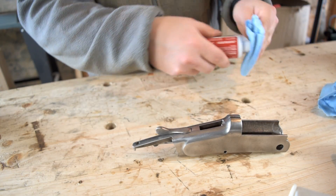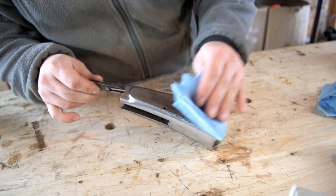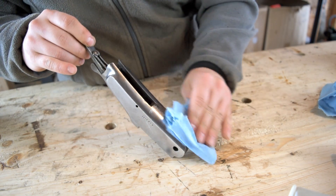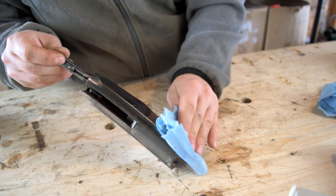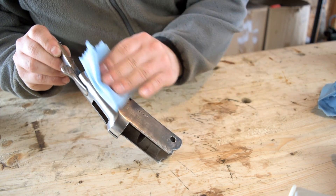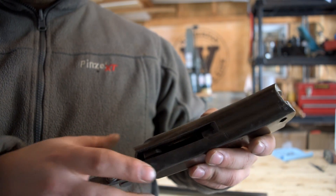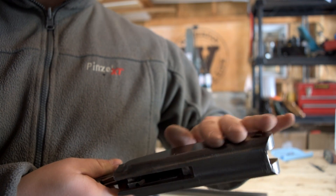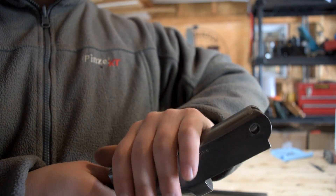When I get the color I'm looking for, we'll stop, give it a final buff with the steel wool, and we're good. I cleaned up this piece with mineral spirits before the first attempt — I should have done that with the other piece too. I usually do that, but I figured with the brake cleaner and metal cleaner it would be sufficient, but certainly not. Just before we put it all back together, I want to show you that blued action and how nice it was — a beautiful luster with that bluing and buffing with the steel wool. I haven't polished this at all; that's just the finish we get. Very nice.